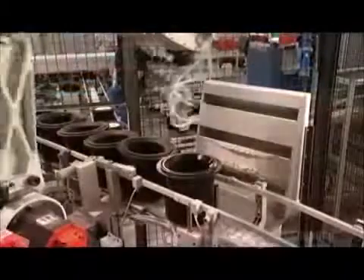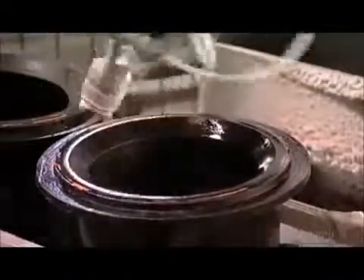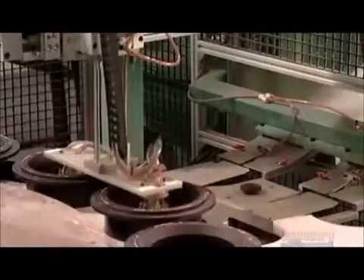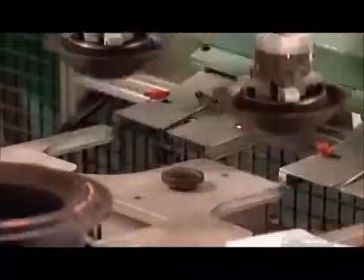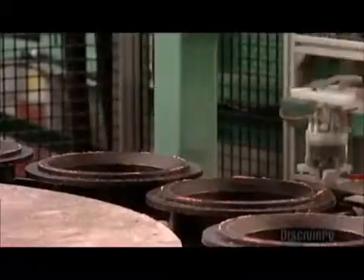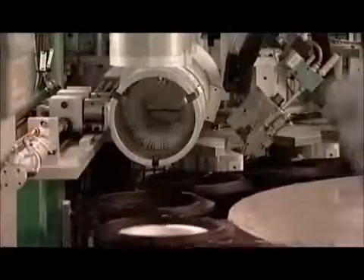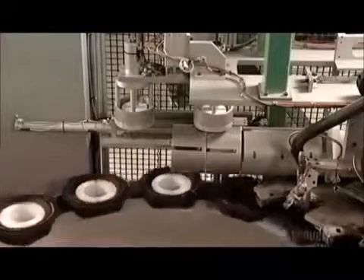On another assembly line, a robot prepares to make a radial seal type of filter. It sprays the no-stick wax onto the brims of molds that look like inverted top hats. A small wheel turns and delivers the molds to a larger assembly wheel. Another robot picks up plastic caps and places them inside the molds. Then a pneumatic pusher raises the caps and nozzles dispense a hot glue bead onto their edges. Another pneumatic pusher tool forces round packs of pleated paper out of cylindrical holders and into the molds.